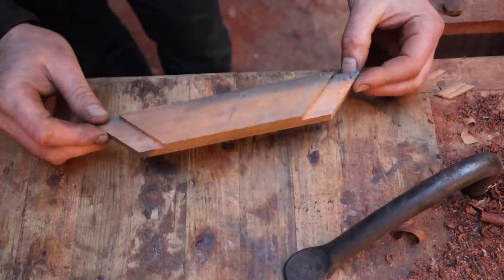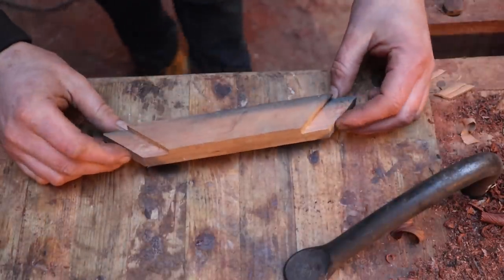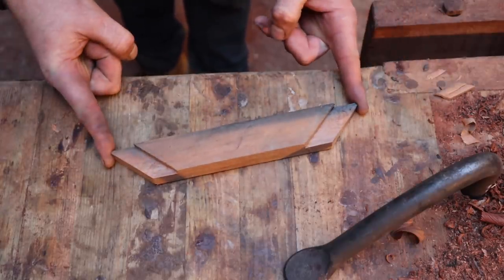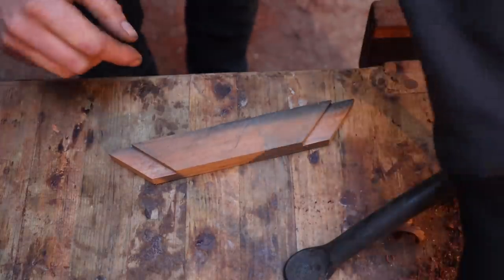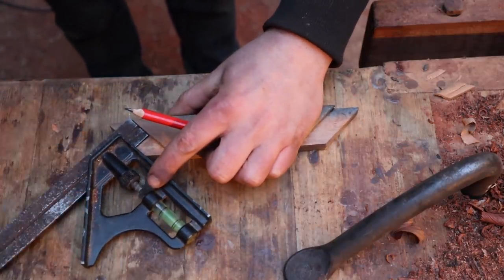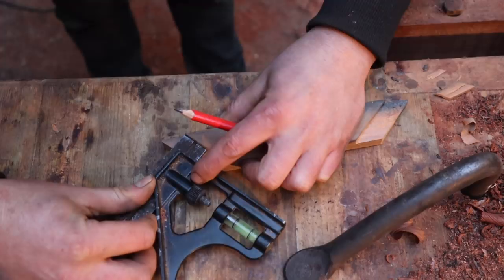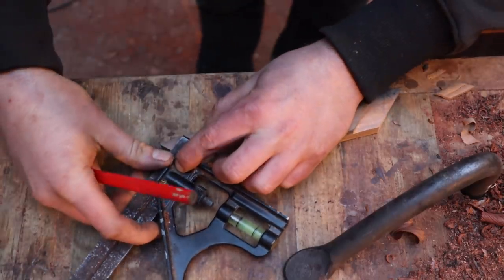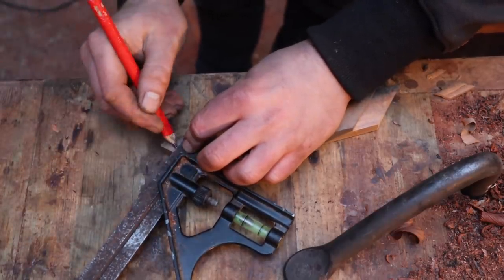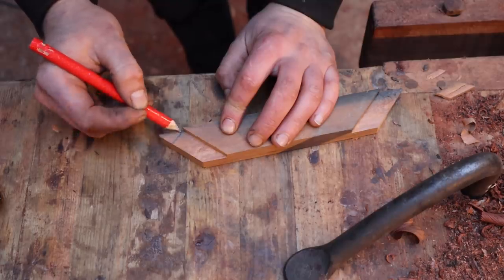Now we have a brace — two shoulders that will sit against the post and two tenons. These tenons aren't going to go into a mortise as-is because the forces applied would end up right on the end of these two points, and that's no good. So what we need to do is take a 90-degree cut off the face down to there, and that gives us our bearing part of the brace — that's where the weight will bear down.